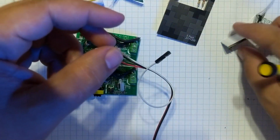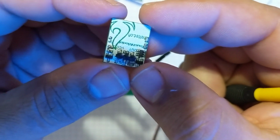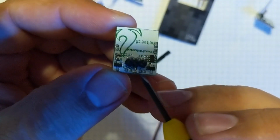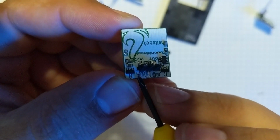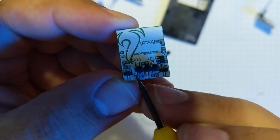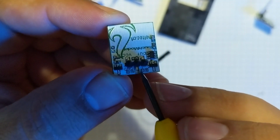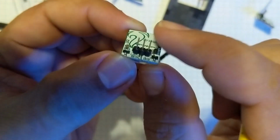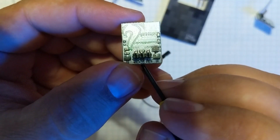One thing I didn't go over is exactly where we need to solder here. So you rip the two pads off. Now, like I said, you have two chances here to solder. The first one that I like to use, kind of out of the way, is the one all the way here on the left, this last pad. That is power to the LED, as well as the left pad on this resistor here. They both go through the board to the positive side on the LED. So you have two chances, however you want to do it.